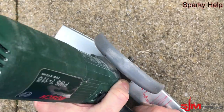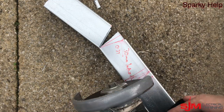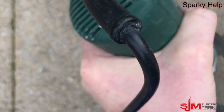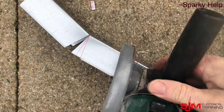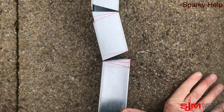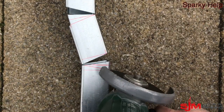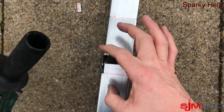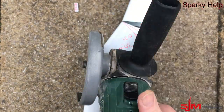Be careful taking those bits out — remember all of this can be done with a hacksaw. And then we are going to cut the other one out as well, but making sure we do not cut the top out. Try and go at an angle all the time, because that is what the angle will be. Cut those, and we need to take those small sections out — so again bend the trunking out of the way, cut at an angle, cut those two sides, and those small pieces will come out.